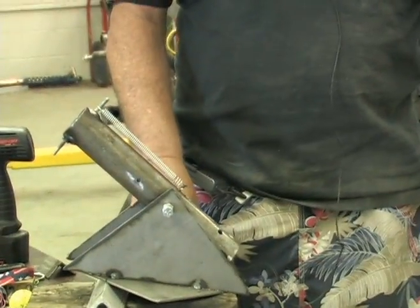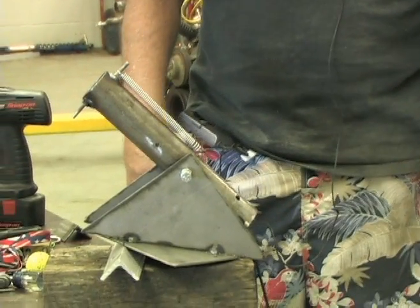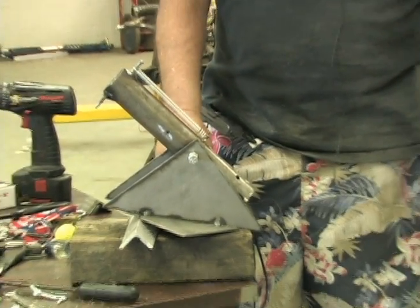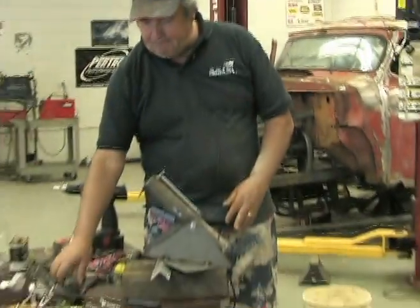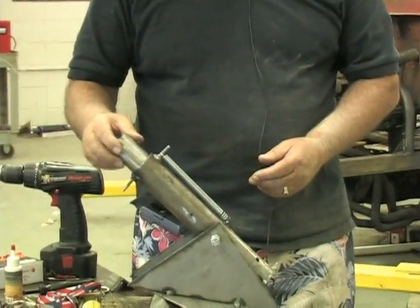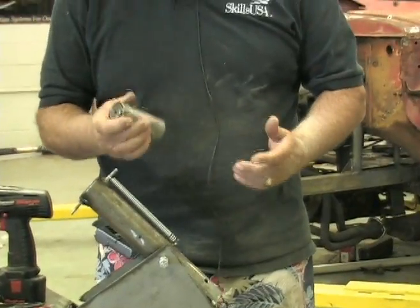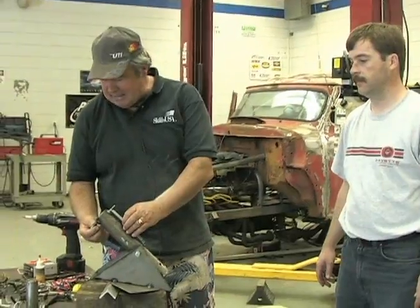We cut this plate out of a piece of metal that I had for a bottom of a wood stove that I bought this winter. We cut that up, about 1/8-inch plate, just boilerplate, and we welded some bolts and nuts on it. We had some problems. Initially, we tried to use this for our plunger, for our thimble down in the bore, and it was just too heavy. We couldn't get the distance we wanted, and we were using 2 springs at that time.